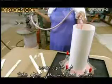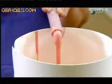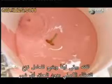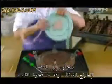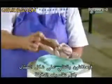In 2 days, the rubber hardens enough to hold the shape and the details of the sculpture, but it's still flexible enough to enable workers to remove the original artwork without damaging anything. After removing the retaining wall, they use suction to gently pull the piece from the mold cavity, which retains the sculpture's shape down to every last detail. Now figurine production can begin.